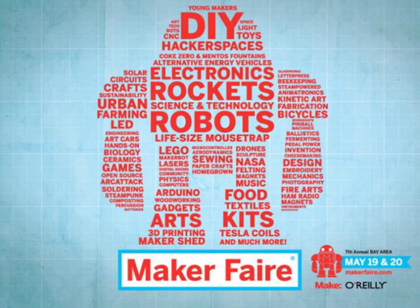Most of the modules have CRCs built in, and we'll be updating all the modules soon to have CRC integrated. What that does is it makes it so that we can detect if there's any errors across the cables. So instead of you getting data corruption, we can simply just downgrade the speed a little bit so that you get slower throughput. In theory, the cable can be whatever size is reasonable to keep the voltage above like 2.7 volts or whatever the minimum is.